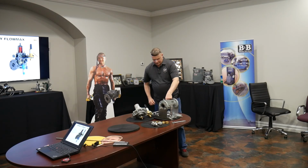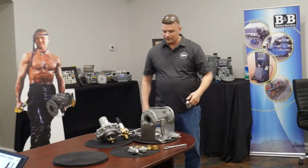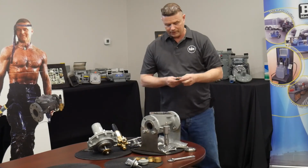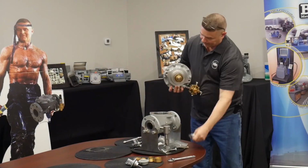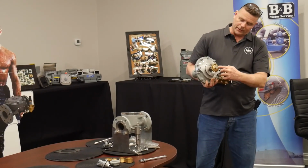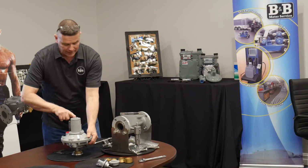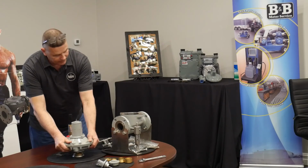Okay, so what we have here is a very traditional orifice, with the capacity set by plug seals instead of throttle plates. On the stem you can see that. This is where it's setting down. The knife edge of that orifice is what's sealing against that exposed nitrile there. That's when the valve is shut. When it opens and the gas the pilot's putting through lifts up, this pin gives a telltale. It shows you the valve is open. You see the pin? Can you see it?